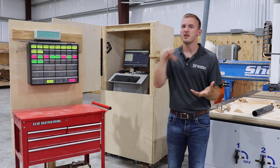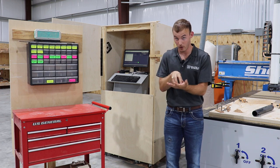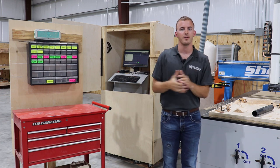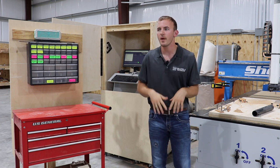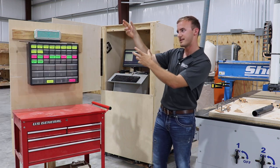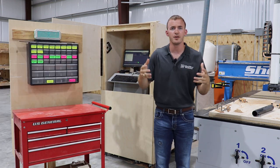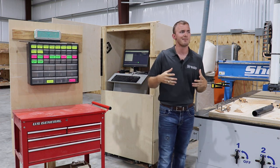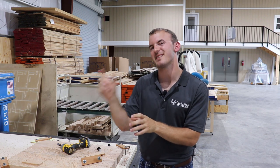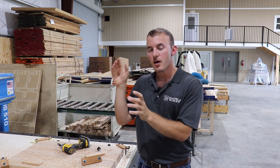First things first, let's go over the number one basic principle that you have to grasp and fully understand to be able to calculate what your feed rate needs to be, what your depth needs to be, all that good stuff. And that number one principle is understanding what chip load is. I'm not going to show you all these crazy charts where you think you have to be a physicist to understand the bit spinning and the angle of the cut — that's good for metal machinists. When you're dealing with wood, it doesn't have to be that complicated. Chip load is the amount of material the bit needs to cut in order to shed the heat from the bit to the material so the bit can stay cool. It's the amount of material a bit needs to cut in order for it to stay cool.